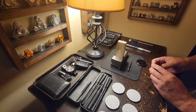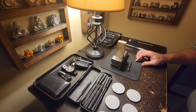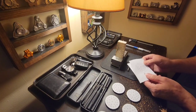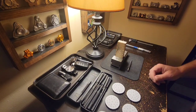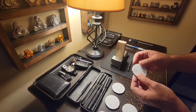So we'll get this stuff out of the way. What I did was laid out the design in AutoCAD and printed it out at the right scale. Then I take scissors and cut these out so that they fit nicely, and I tape them temporarily to the lids — and that'll help me locate everything.